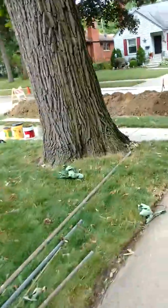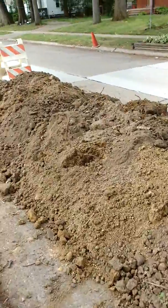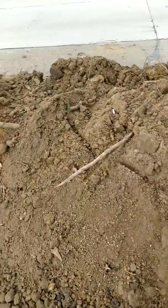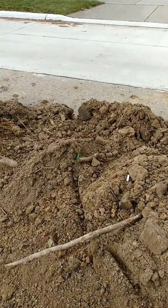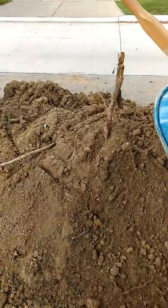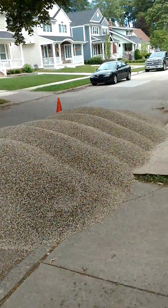The reason you ladies didn't leak more often is simply because you got mostly sand, not clay. Most of the jobs we've done here is clay. The sand allows the water to go through, unlike clay. Clay soil — the water won't get through the clay, plus there's a lot of underground roots that soaked up a lot of the water. And that's all the gravel that's going in.